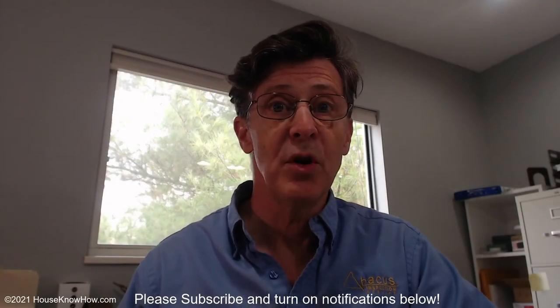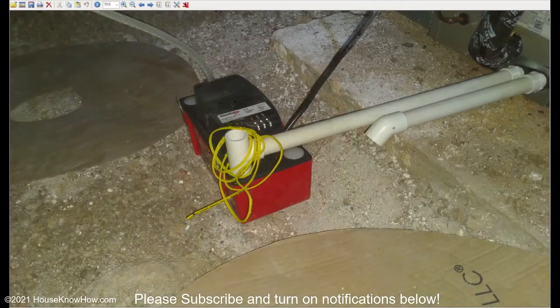What does a condensate pump do? A condensate pump collects condensate from an air conditioner or a condensing furnace. The condensate will run through a pipe or a tube down into the condensate pump's reservoir. As the reservoir fills up, eventually one of the float switches will turn on the pump, and the pump is going to pump water out of the reservoir to a drain somewhere in the house, or sometimes to the land outside the home.